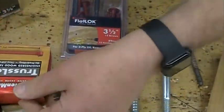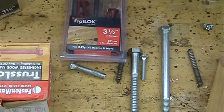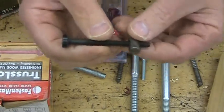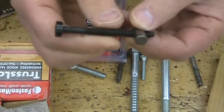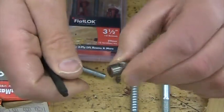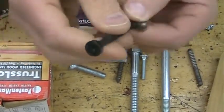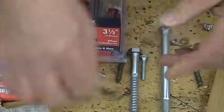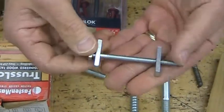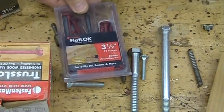Again, there are all kinds of specialty fasteners out there, and we could probably go on for hours talking about different kinds. There are different kinds of fasteners for drywall and other things. There are also fasteners used for disassembly where you drill a hole from one side — knock-down furniture uses this kind of thing — and this round tube is threaded. This goes into the wood from one direction, the bolt goes in from the other, and you can pull two pieces together at the same time. The head is a little bit decorative, so it's okay to have it showing. Here's another kind of fastener used for countertops, drawing two countertops together from underneath. There are thousands and thousands of different kinds of specialty fasteners, but I just thought I'd enlighten you on a few of the ones we have here.